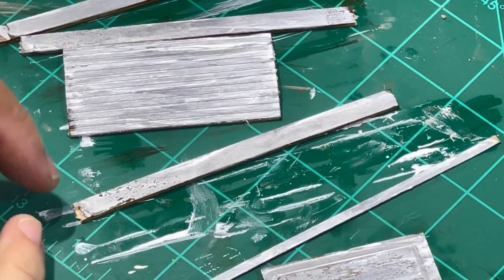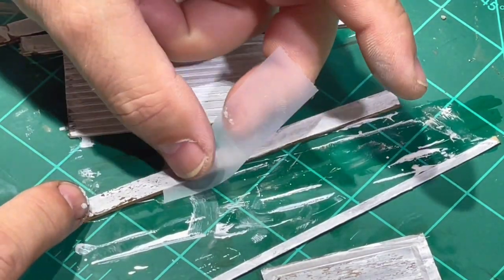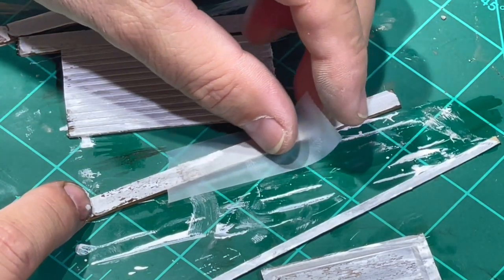This takes some finesse — it's not just get in there and jam that tape down and pull it off. You want to be really subtle with it. If you push down too hard, when you pull up it may pull up splinters of the wood, which won't look good. Notice how the lines are going with the grain — that's one of the reasons we exaggerate the grain. Look at that contrast! That's beautiful, and it even leaves a little bit of the pigment in there so you have that darker old wood.